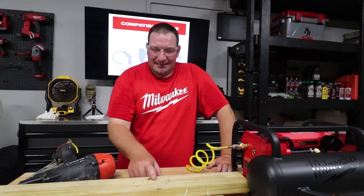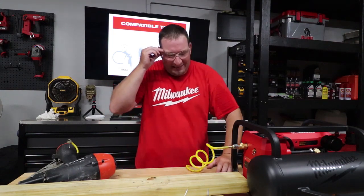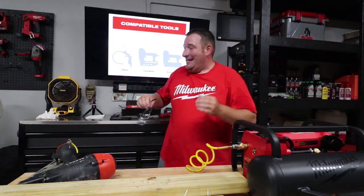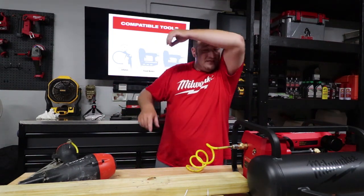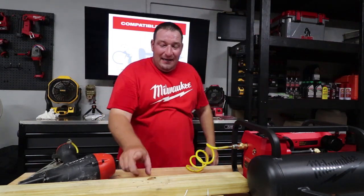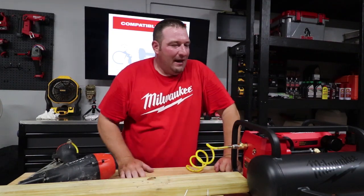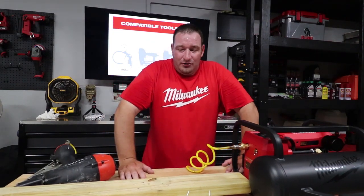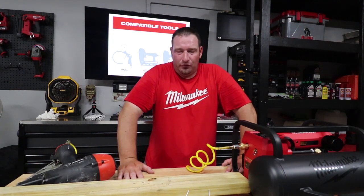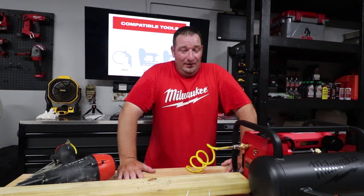That's nine nails. Took us from 135 PSI down to 80 with nine nails. So it's not lightly by any means. But on a side note, it impressed me. It sunk every one of them. I thought you was probably going to get about two before the compressor kicked on, which we was right on that. But I did not think after that it was really going to sink these things.